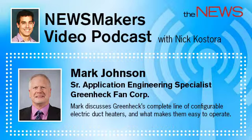And so, if someone's choosing a GreenHeck duct heater over other brands, why are they doing so? GreenHeck duct heaters offer many standard features that are typically added-cost options or simply aren't offered by many other manufacturers. Every GreenHeck heater is designed and UL-listed for bi-directional airflow. This means that if the duct work is oriented horizontally, any GreenHeck heater can be installed with no concerns about which direction the air is moving, giving the installer flexibility to put the control box on either of the vertical sides of the duct in virtually all instances.